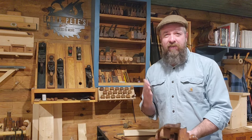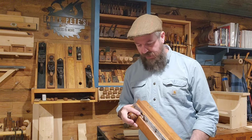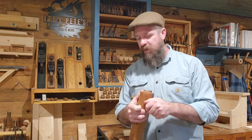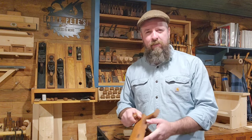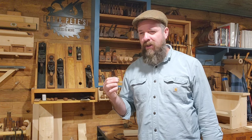It's kind of like a molding plane with a fence. I love wooden planes and I love the wood screws on here. One thing to note: whenever you're using anything with wood screws, when you're done using it just loosen them a little bit. If you don't, the expansion and contraction from moisture or temperature will make those wood screws start cracking and breaking in different spots, which naturally happens over time.